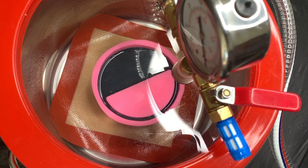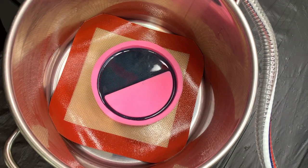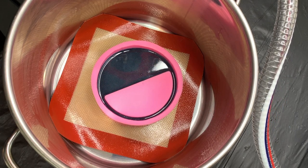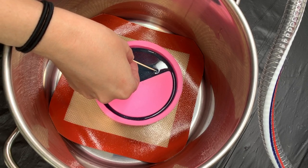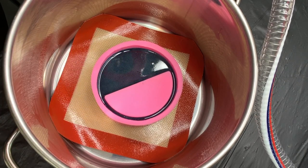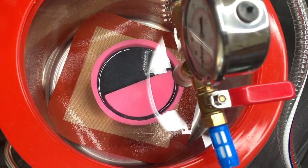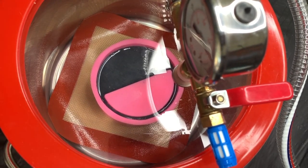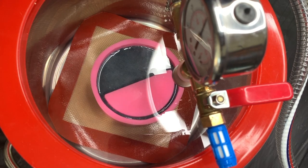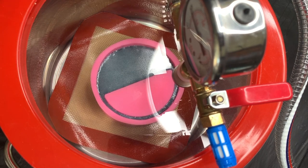The reason I leave a space in the mold is because of the amount of bubbles that come up. If you don't leave that space the bubbles will overflow, like I showed you in that fail video at the beginning. This is not a pressure pot — you can't just leave it and forget it. But I can also do this for coasters: put one coaster in, do my process, put the second coaster in, do my process, and so on through a set of four or six — that way I don't have any issues with bubbles at the bottom of the cast, which when you unmold it ends up being at the top.